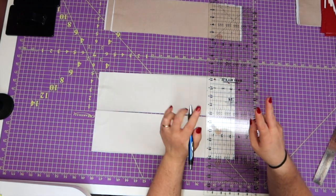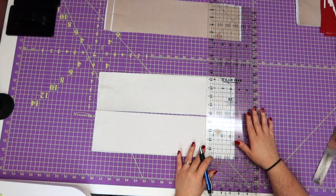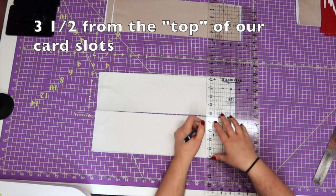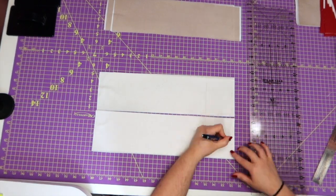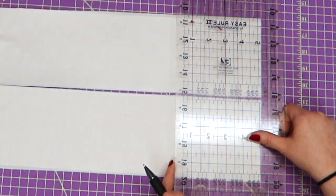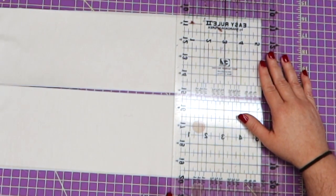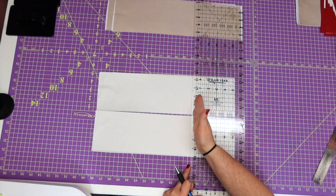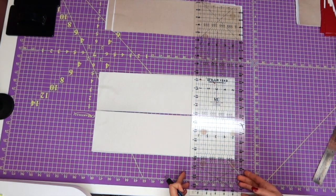The top of our card slots is going to be our first mark, and it's going to be three and a half inches. We're going to measure over three and a half — I'm going to put a T on this one to know that this is the top of my card slot. The next measurement we're going to use is one and three quarters, so you're going to line it up with the three and a half mark and move over one and three quarters.